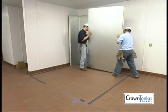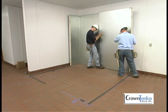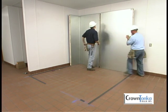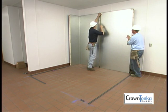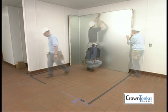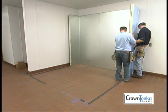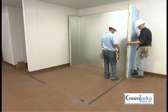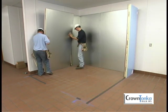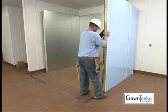Repeat the operation to extend the wall toward the second corner. Check the blueprint to get the correct wall panels. Check to be sure each wall panel is tight against the previous one. Once the second corner is complete, construct the next two walls — the ones that face each other — at the same time. Add a panel to one, and then the other, and so on.